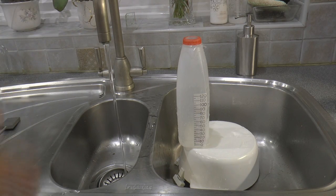So that's no good. So what we need to do is to destroy the crystal structure on the surface of the aluminium, which is the cause of that reflection. And we do that by oxidizing the surface. Now there's a special process of oxidation called anodizing, and depending on the process that you use, the depth of anodizing can vary.